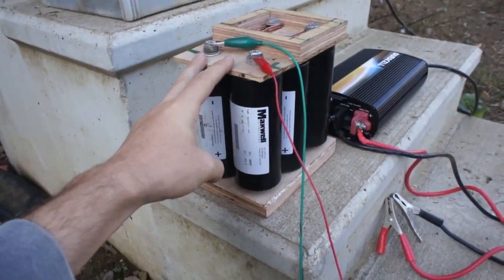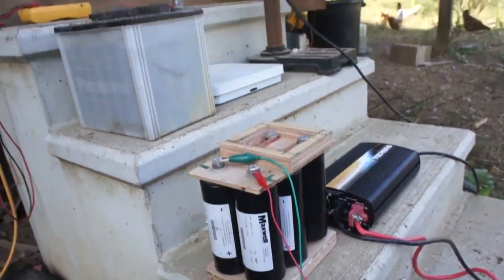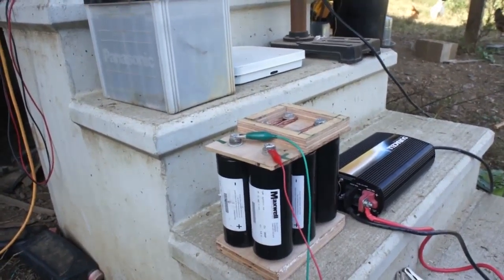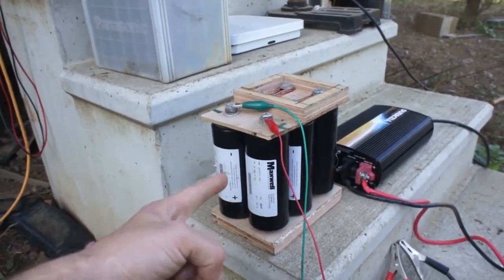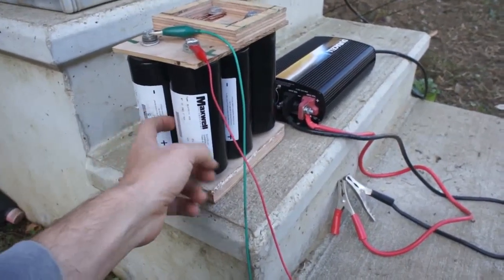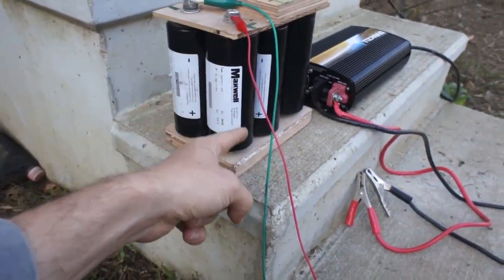I just want to point out another use case for a boost pack like this — in a small off-the-grid workshop. These would come in really handy if you don't run a prolonged load. If you're the type of person who has a workshop where you just flip on a drill press for a minute or two, flip it off, then come back later — maybe you need a belt sander for a couple minutes. With a solar panel topping these back up really quickly, and with millions of charge-discharge cycles on these capacitors, this could be a really interesting off-grid workshop application. Not so good if you run power tools for a prolonged period though. The power is coming from this small 13-watt solar panel.